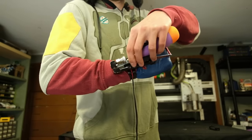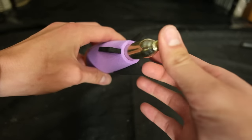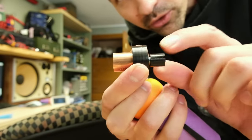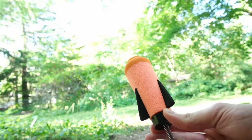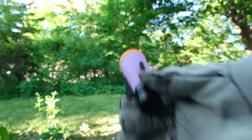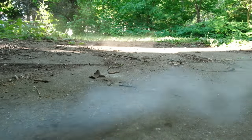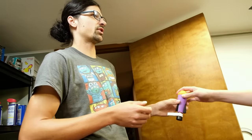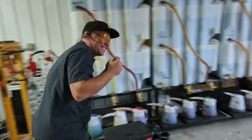It shows us that the inside of a Nerf missile is the perfect diameter for a 12-gram CO2 cartridge. And this is where things get really stupid. At first, I tried to design a simple spring-loaded puncture mechanism for a handheld launcher, but the spring wasn't strong enough, only making a tiny weak pinhole. So I tried smacking it, but the tiny handle made my grip too weak to transfer enough energy to the puncture button — unless I just smacked the whole thing against the ground. When an even bigger handle didn't solve this problem, let's just say we did something too dumb to mention and paid the price. Seriously, don't do this or anything that you see in this video.